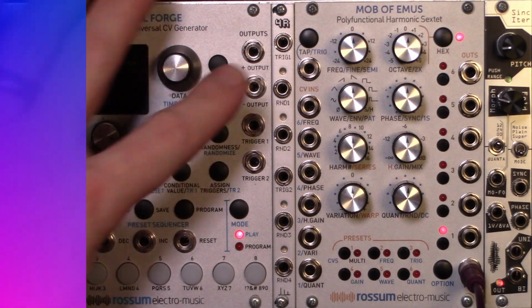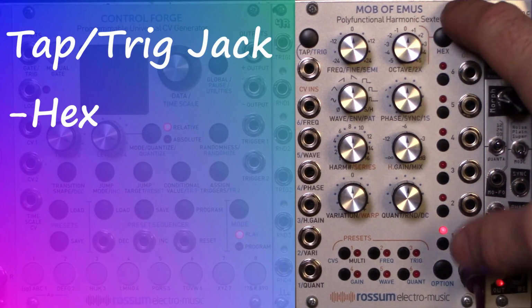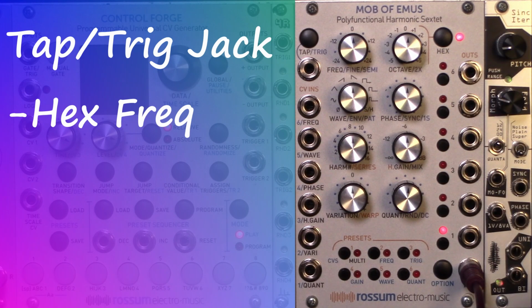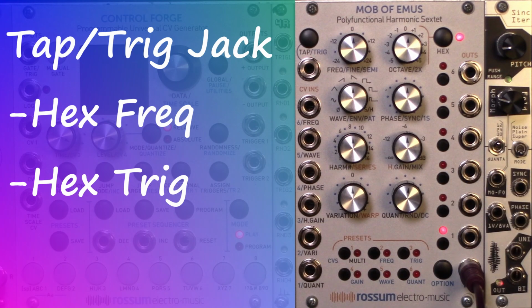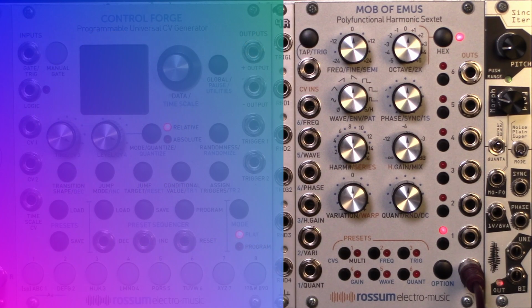The associated jack below can function in one of 3 modes. We have hex mode frequency, which affects the rate of all channels, yet allowing for phase misalignment. Then there's hex trigger, which we just covered but doesn't affect the frequency or rate of our channels. And then there's both simultaneously, which is the default and is good for clock sync and keeping everything phase synchronized.